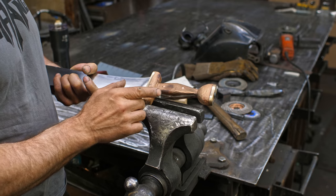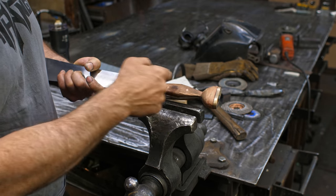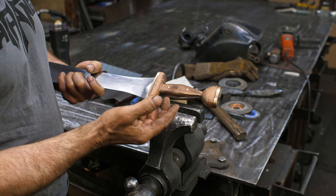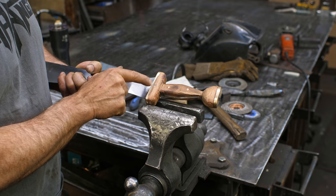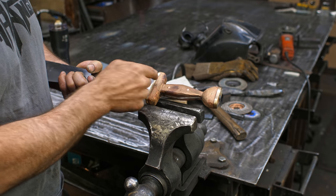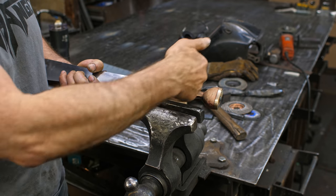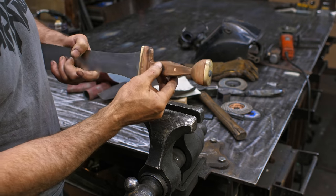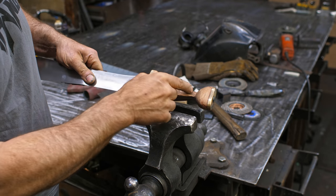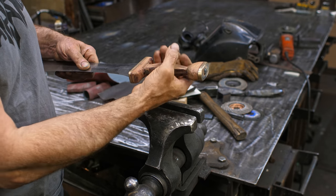So anyway, what I have done in the meantime is epoxy on my various pieces of wood. The process went something like this. I slid on the quillion, if you call it that, and then the wooden quillion part with some epoxy on there, got that slid into place. Then I put on my two slabs and copper pins into that. They were clamped on and epoxied and everything.